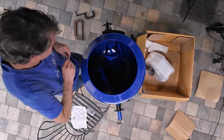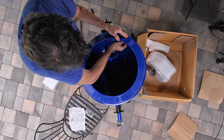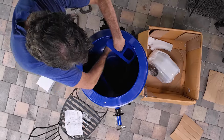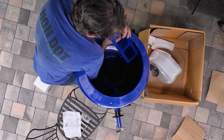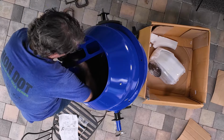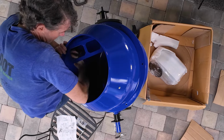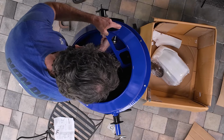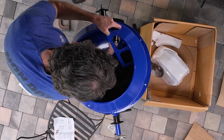Secure the mixing blades to the upper drum by inserting two cross-headed screws from the outside through the holes in the drum. A leather washer should be positioned in between the drum and the blade, securing the mixing blade on the inside using a flat washer, lock washer, and nut. Check that all the nuts and bolts are tight.